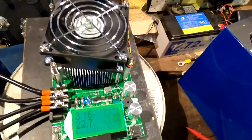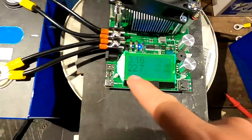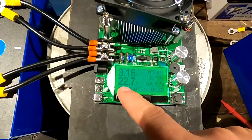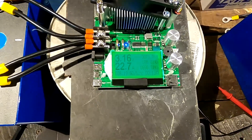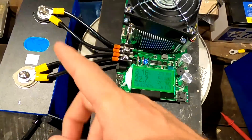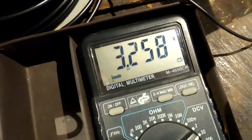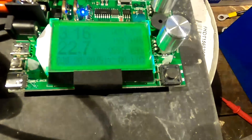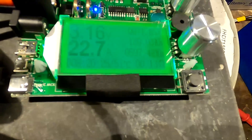The test is still running — we've pulled 188 ampere hours out of this battery. The voltage is holding at 3.16V on the display, and the amps have dropped slightly from 23 to 22.7, because as the cell voltage drops, the amps drop too. Measuring directly at the terminal: 3.26 volts. Still going super strong. We've already pulled 0.6 kilowatt hours out of this battery.